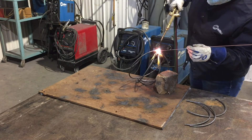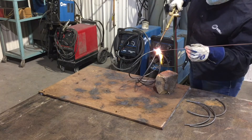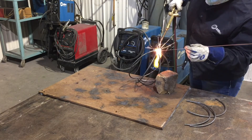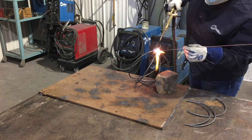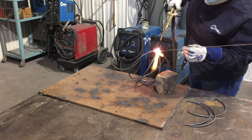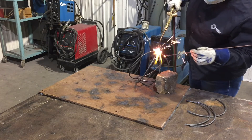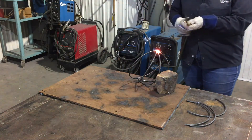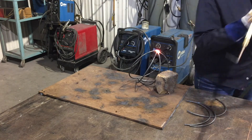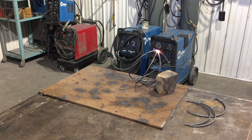I see some sparks coming off — that's a good sign. You'll also notice I'm feeding in a little bit of filler rod and then sometimes pulling it away a bit just to let it harden. Move my torch to the next spot, heat it up and fill in some rod. You're trying to get the rod right in between the hot metal and your flame to allow a little piece to drip off.